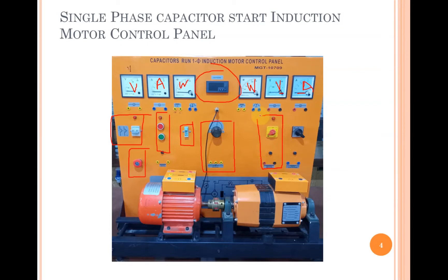There is a DC power supply used for excitation of the DC generator, and we have a one-phase load. You can see this is the induction motor — it has six terminals: two for the capacitor, two for the starting winding, and two for the running winding. This is the DC shunt generator, which we have been using throughout our lab experiments, with four terminals: two for field winding and two for armature winding.